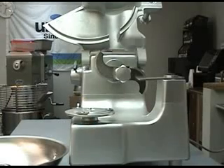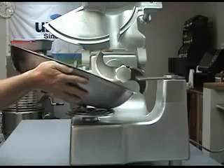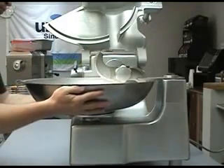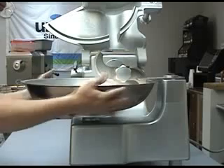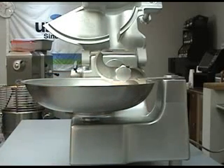The BC-18 uses an 18-inch diameter polished and die-drawn stainless steel bowl. It rotates at 22 RPM when the unit is being used. To install the bowl, place it on the unit and twist until it locks into place. A safety sensor prevents the machine from operating without the bowl in place.